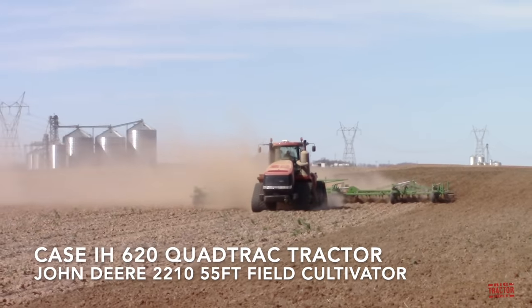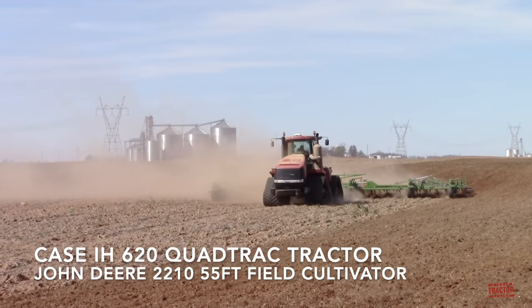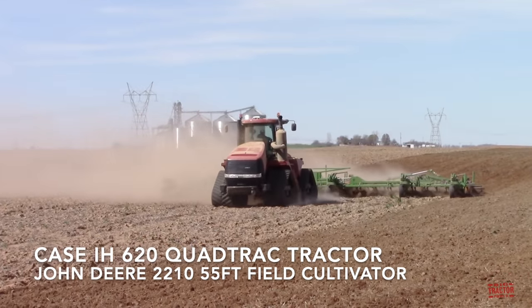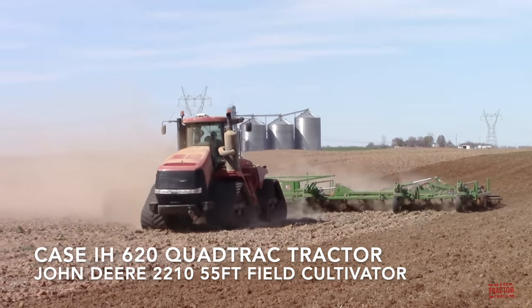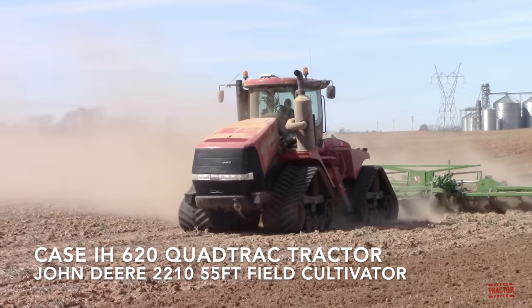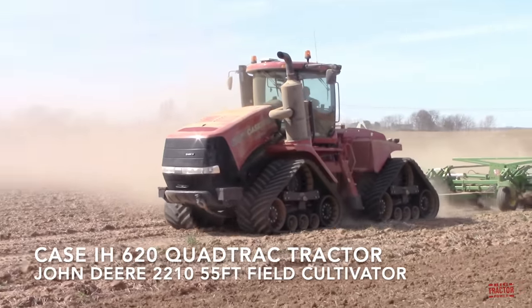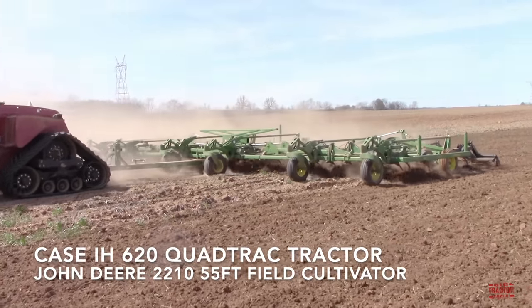In the fields that the farm completes primary tillage on in the fall to break up compaction from the previous year's harvest, the farm utilizes a model year 2017 620 engine horsepower Case IH 620 Quadtrac. This big tractor is pulling a 55 foot wide John Deere 2210 field cultivator. The field cultivator relies on sweeps that can work up to 5 inches in the ground.